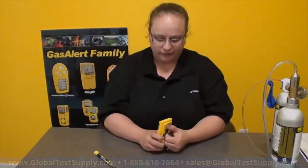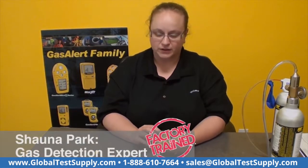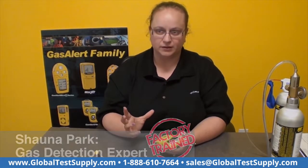Another important maintenance with the gas detectors is the replacement of sensors. Calibration, bump testing, sensor replacement, these are things that you can do in the field on your own. They don't have to go back to a service center or to the manufacturer to do that regular maintenance.